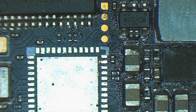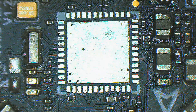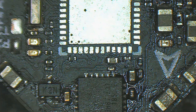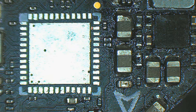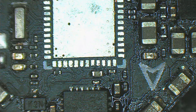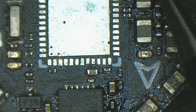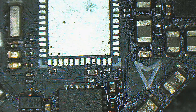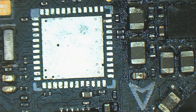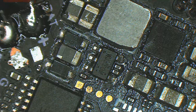I don't like how this cap looks here, and now would be the best time to check if something is indeed wrong other than the MCU. I powered the FC to the LiPo input with my lab power supply and found that there is still a high current draw on the FC — the regulator is still buzzing. This little IC here, which most definitely is a regulator for 3.3 volts, is getting pretty toasty.